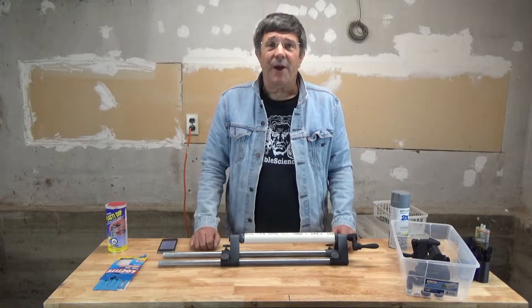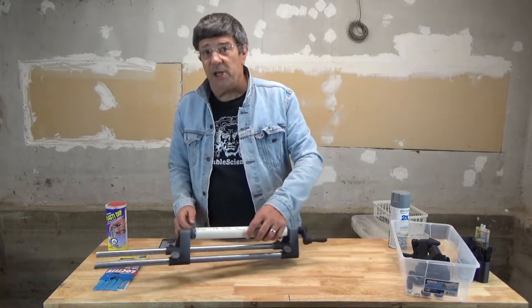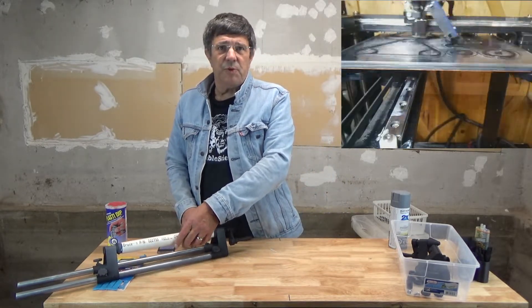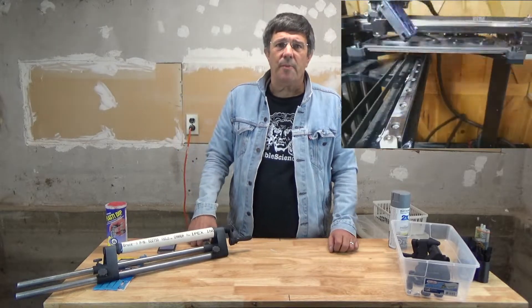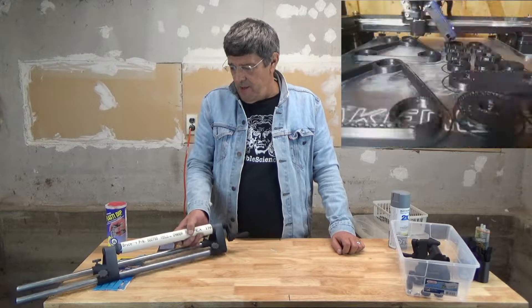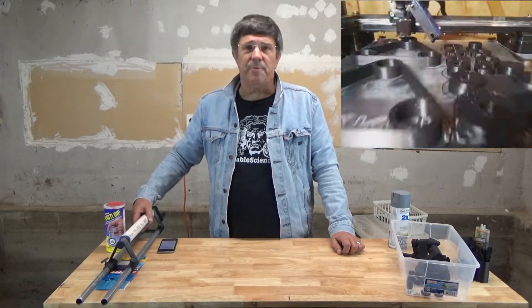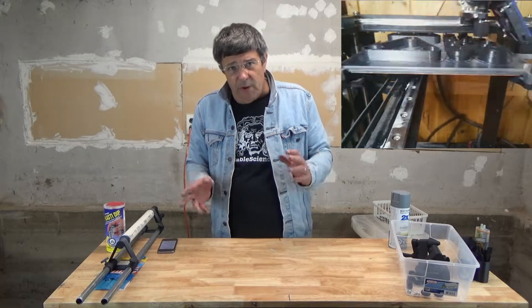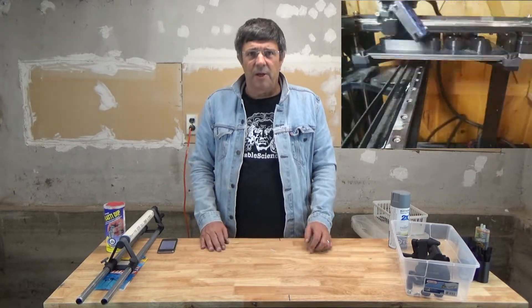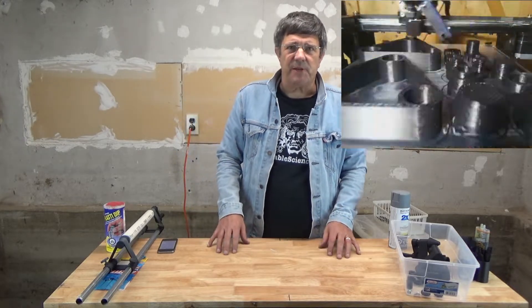At this point all you have to do is apply the paint. There are a number of parts we used in our painting jig which we printed in PLA with a 0.4mm nozzle, 2 perimeters, 0.2mm layer height, 3 bottom layers, 3 top layers, and a 20% infill. Except for anything with an exterior thread, which needs extra strength — print those parts at around 75% infill.